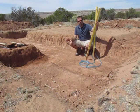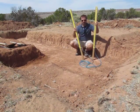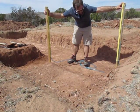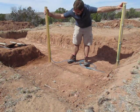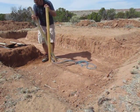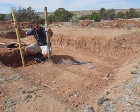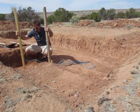Now that I've dug out even further I'm going to show you how to make a measurement by yourself when you have to cover a longer distance than your arms will reach. First, I'm going to find that initial starting point and find a point over here that is perfectly level. It's important that it be perfect — not just within the range of tolerance — because if it isn't, that error will add up over the number of times you move the level. I've got 22 and 22, that's perfect. Then I'm going to move over here and measure this new area I've dug out. In this case I have 23 and 22 and three quarters, so that's within my range of tolerance and I'm good to go.